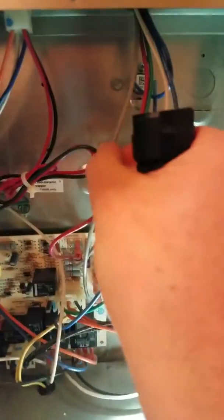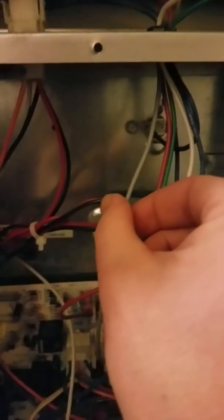So what you want to do is look at these wires. You want to locate the C-wire. The C-wire is the bottom one there — kind of shining my light on it, but there it is right there. See that right there? It's going to be hard to tell on video, but this C-wire is actually gray in color.